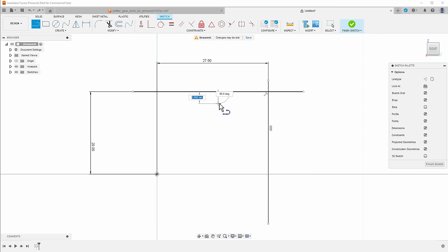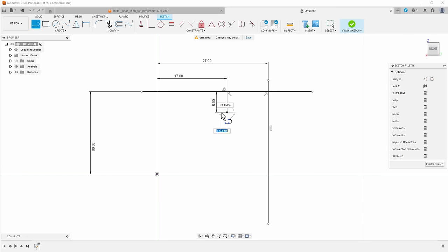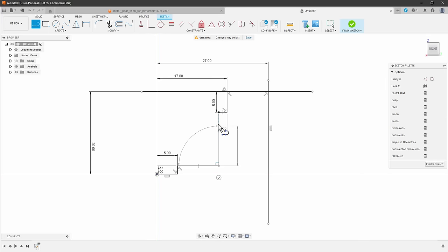There's a small rim on top about 5mm tall, so I draw a line 5mm tall. The inner hole is about 34mm in diameter, so I sketch the dimension from this line to the center as 17mm (34÷2). I draw a small 2mm step, then a 2mm floor at the bottom with a hole for the bolt — about 10mm, so I type 10÷2 for the radius. I then connect the pieces together. Some lines get turned into construction lines since I only need four or five normal lines to define the geometry.